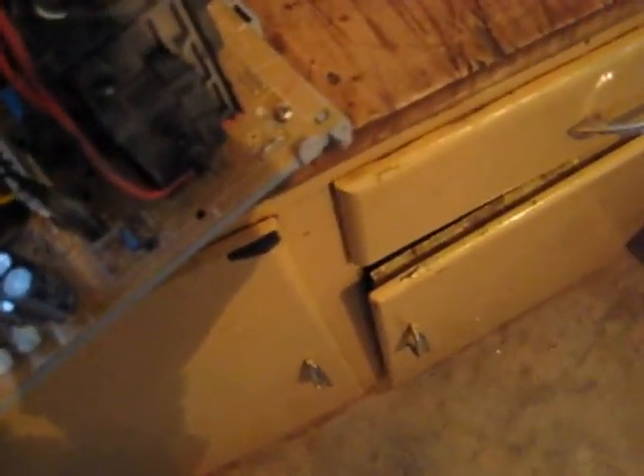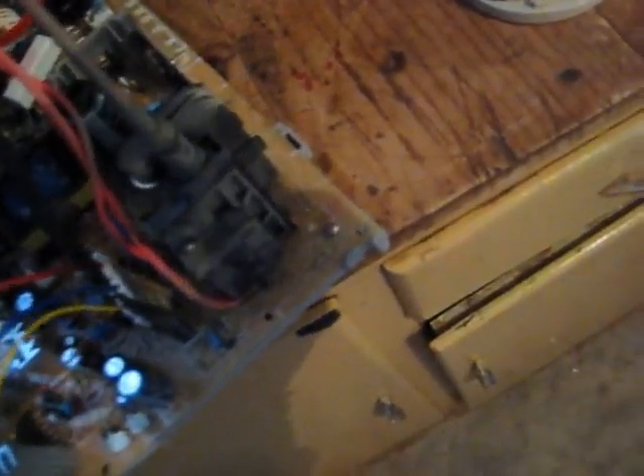We'll show you what the bass will do. To the beats of the music, the screen will scan to the beats of the music. And with the horizontal — you plug the vertical coils into the horizontal supply — so the horizontal ends up being scanned vertically, so the picture is sideways. And you use these as your inputs for your signal. So you have the oscilloscope wave — it only takes up half the screen. So first of all, I'll just do the vertical alone and show you what the picture looks like.